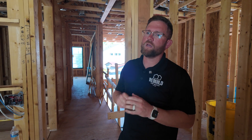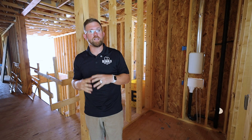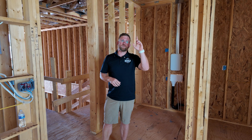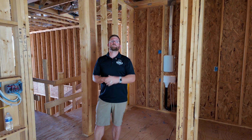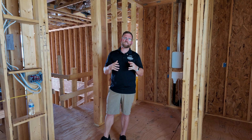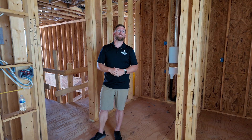Similar in nature to bedroom 5, in bedroom 4 we wanted to get a vault once again — not only to create a better aesthetic for modern-day living, but also to increase the volume. However, we weren't able to go with a parallel cord truss, so we went with a king post truss — a vaulted scissor truss — that allows us to get the vault in this space and provide maximum structural rigidity to this portion of the home.